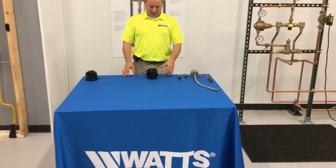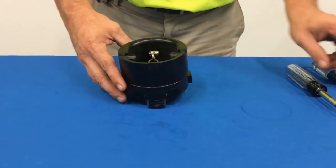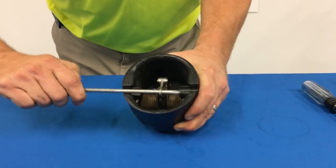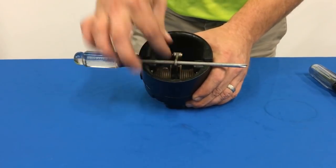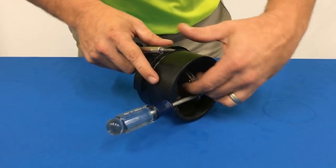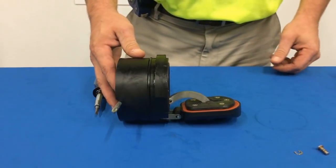Now that we've got everything removed from the device, we're going to come over to our table and work on the proper steps to take this apart and get it rebuilt. The first step is to grab our number 3 screwdriver. You'll notice there are two slots on both sides and a hole in the cam arm. First we're going to slide it through the slot and into the cam arm — what this does is hold the tension from the spring on the inside. Second step: we have a small C-clip holding our pin to our cam arm. We'll remove that, then push on the pin and remove it. Now we're completely open.